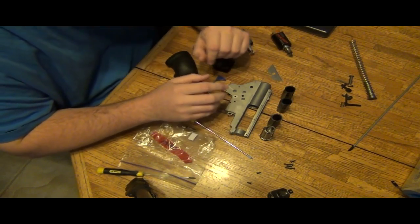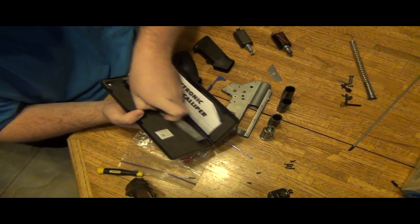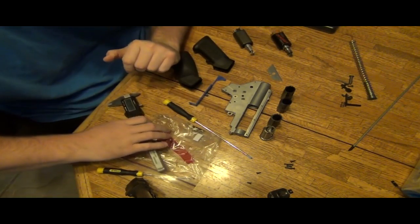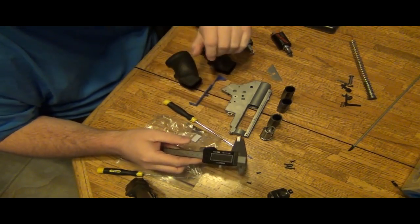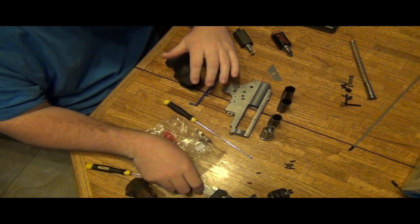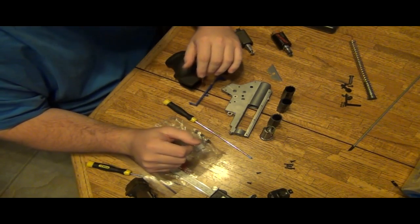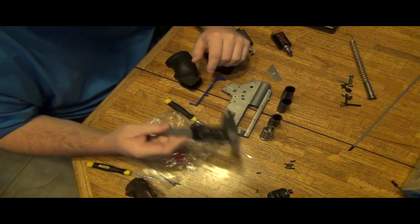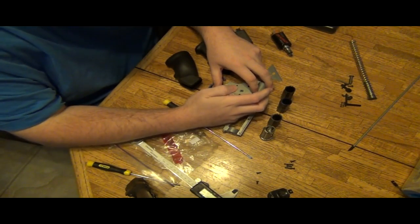Now I'm going to explain how the caliper becomes very handy right now. I have noticed, and I'm sure some people are going to comment about this, that the shims from different shim sets are not exactly what they're stated to be. So if they're 0.1 millimeter, they're sometimes 0.06, 0.07, 0.08, 0.09.